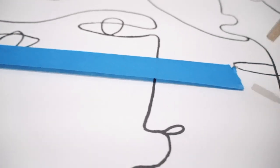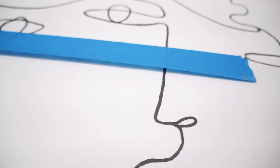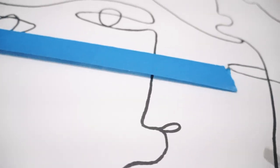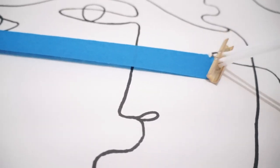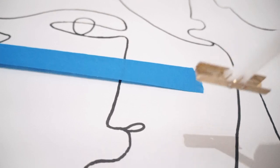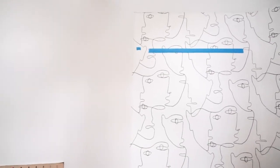So, like I was just trying to explain, you'll make a bigger hole, not too big, start small, and then make it big as you go, because you can't do it the opposite way. You poke this in, once it goes all the way in, pops back, holds the back of that drywall. But yeah, I just wanted to share that real quick. So let me get this mirror up and we'll be back.